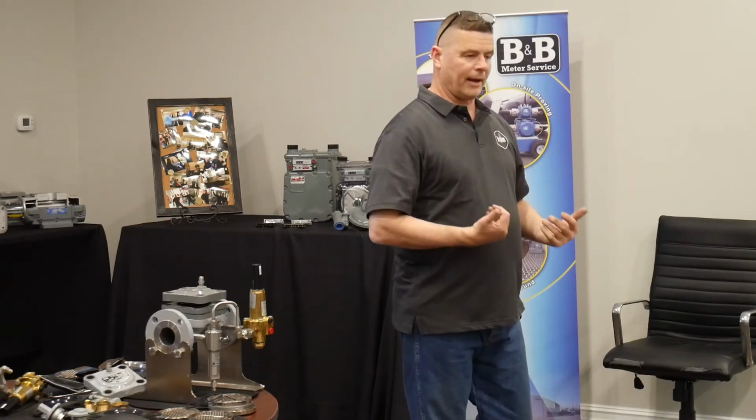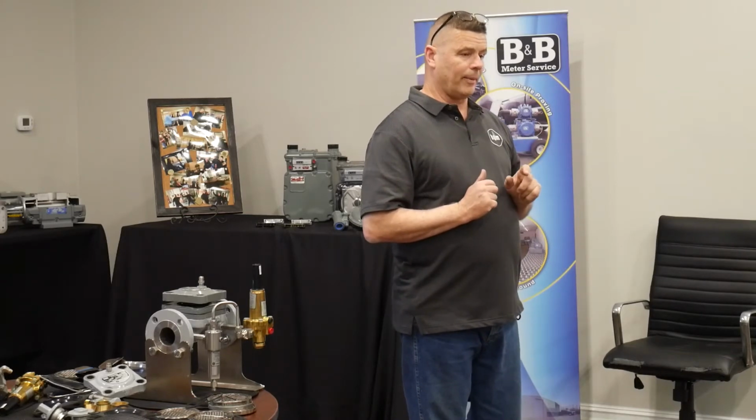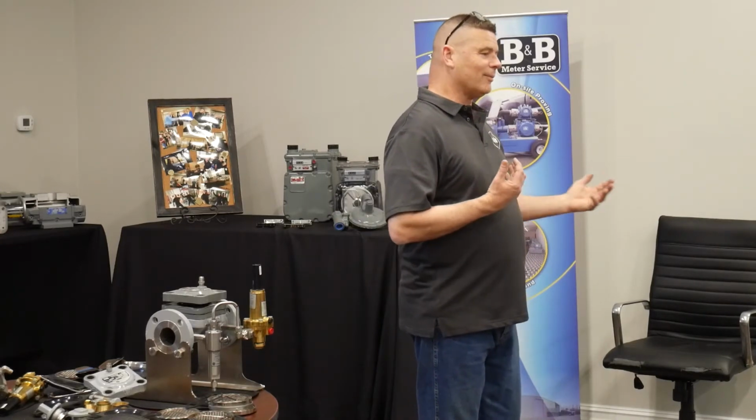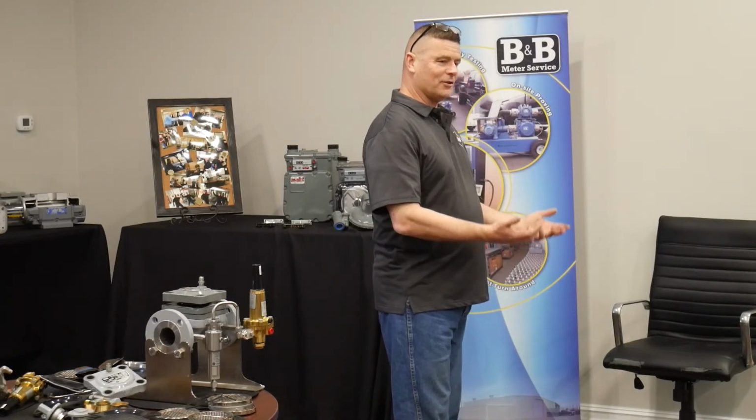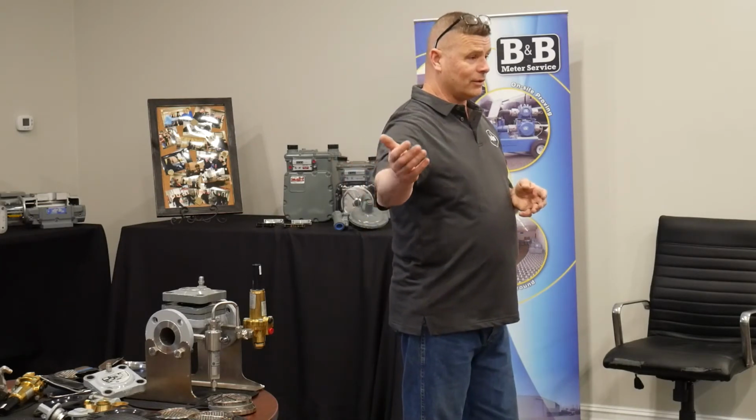Who has a question? Okay. CG is a gas sizing coefficient. It gives us an ability to compare two valves and their capacity at basically the same pressure conditions. If I have a higher CG, that means the valve's going to have more capacity. In this case, if I just put in a large port conversion kit, I've increased the capacity like 20-25%, depending on the throttle plate. What if this is one of those situations we want to make sure everybody's doing, and that is protect your regulators with a relief? I've just increased the capacity by converting this. Can the relief cover that new capacity?